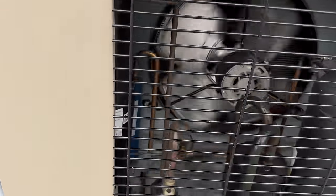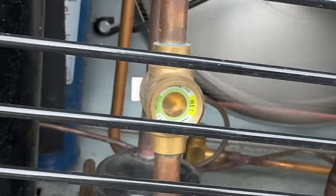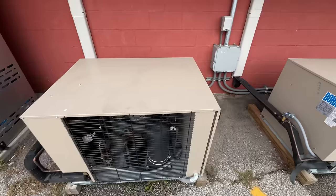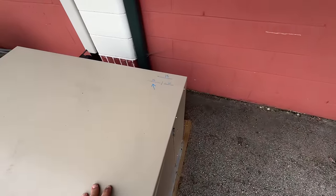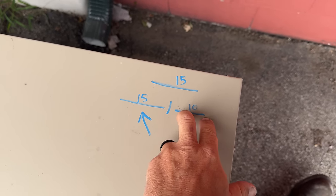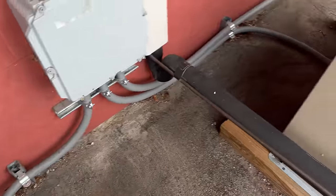We've got two of them that appear to be low. Our sight glass here is about half full, so we know we have a leak on that one. This one wasn't looking very good earlier but it's kind of halfway okay, and then this one was full the last time we looked at it. This one here is freezing up so we've got problems with defrost. Coils and stuff look fine.